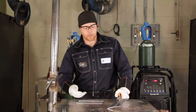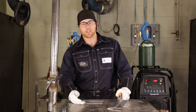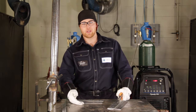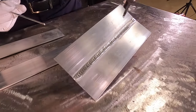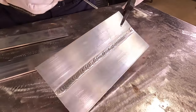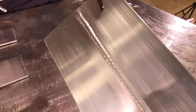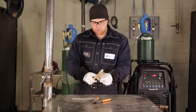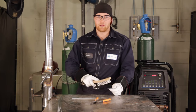One thing that makes getting full penetration on aluminum very tricky is that oxide layer. That oxide layer actually melts at a higher temperature than the aluminum itself does. If you look, it does not look like the weld on the back side — it almost looks like it has some sort of a film over top of it, and that is the oxide layer. I'd like to reiterate how much cleaning aluminum affects your weld.